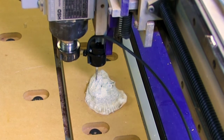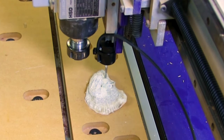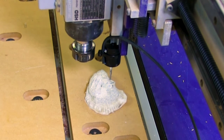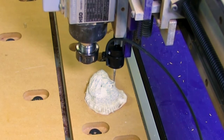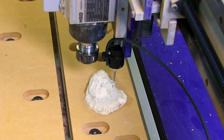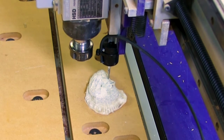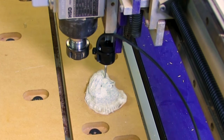Every one of those touch points is being recorded. Keep in mind that you can change the resolution — you can get those touch points really close together, which will result in a lot of detail in the final carving, or you can move them further apart, which makes this step go faster but you won't get as much detail. Because of the amount of detail in this shell, I wanted to keep the resolution nice and tight. I really thought this would be a great test of what the probe is capable of. As the probe moves left to right, when it touches the shell, it's recognizing that there's a contour change. The thickness difference on the shell is from zero at the spoil board up to about three quarters of an inch at its maximum thickness.